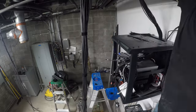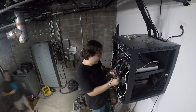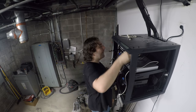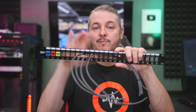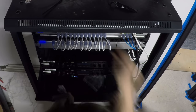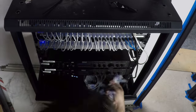Once you have all that in, bundle the cables together using lots of Velcro — Velcro makes your life easier and makes the project very serviceable. We put all the Velcro on and then comes the looming of how we pull it all into the rack. This particular job has roughly 40-some-odd drops, so we actually use two 24-port patch panels. Having a 24 on top and a 24 on the bottom with a 48-port switch in the middle is what gives you that cleaner look when using slim run cables going back and forth.